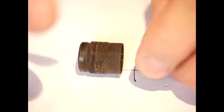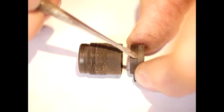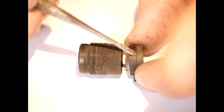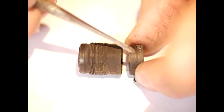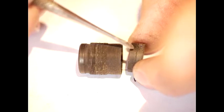On the side there's a bit of a clue as to what's going on here. What we effectively have is a lens group that has been put together with some kind of sticky resin. Over a period of time, possibly if somebody's dropped the binoculars, the resin has become fragile and cracked and shattered inside — but the glass itself is probably very intact. Because this kind of resin is very old, it just comes off with solvent.